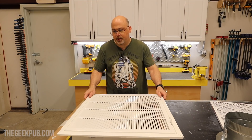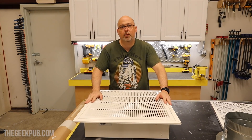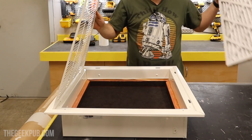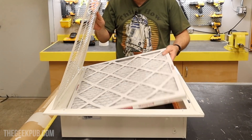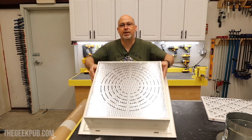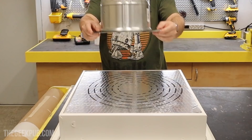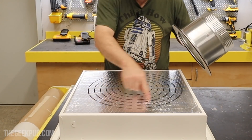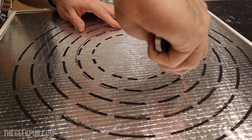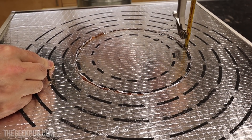One of the first things we need to do is install a return air vent in the server room — it doesn't have one today. This is just a regular return air vent that drops into the drop ceiling like a ceiling tile. It has a place to add a filter, which we definitely want to filter any air coming out of the server room before it goes into the return box on the AC unit. On the back is a starting collar for HVAC — there will be a duct that comes off this and goes to our motor. The bullseye marking tells us where to cut the hole. I first tried a regular box knife, but the material was much too thick, so I had to come back with a hacksaw blade.